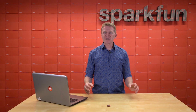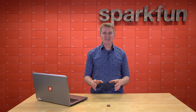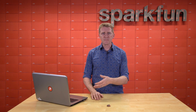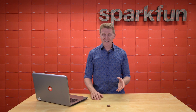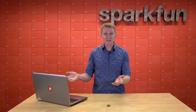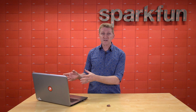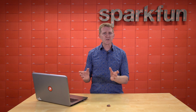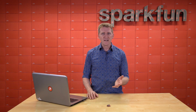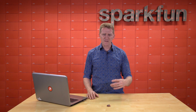Today I just want to talk about the standard firmware. If you're looking to log a ton of data quickly and simply, this is your out-of-the-box solution. Connect it to your computer, open up a terminal window — it's going to auto-detect close to two dozen of our quick I2C boards and just start spitting out data. Even without an SD card installed, it'll still feed data directly to your terminal window: TeraTerm, Realterm, whatever you're comfortable with. You can even use your Arduino IDE's serial monitor to read the data.